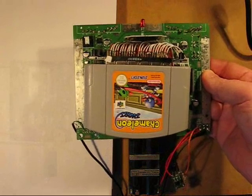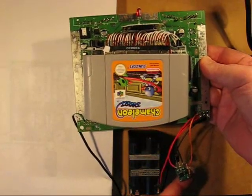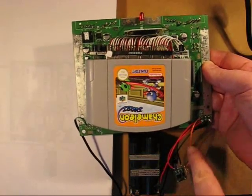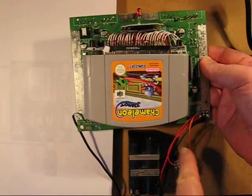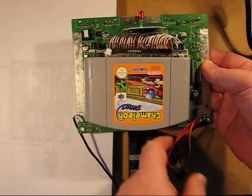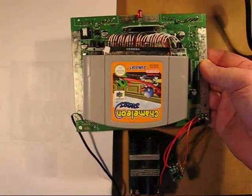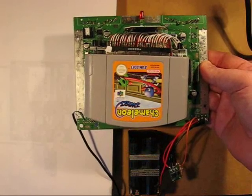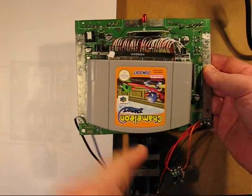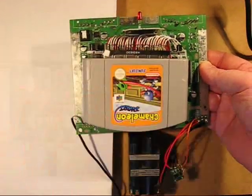The system is now wired up. I've used an orange wire for 3.3 volts, red for 7.4 volts, and black for the negative. This is 3-amp cable — very flexible and capable of the amperage required. The screen and system will both run off the single cell.